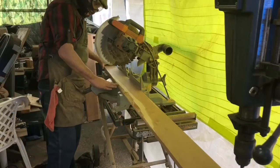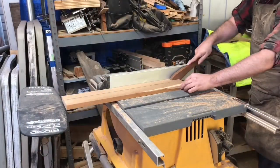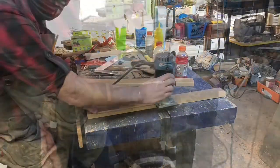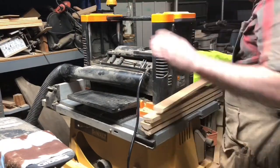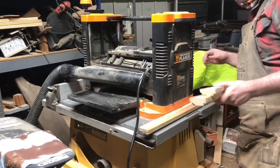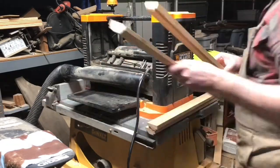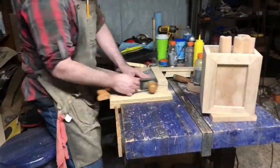In order to know how long the columns needed to be I needed to work on what I called the capital and the base, which are basically reflections of each other. I had to make two of the same thing — essentially like making two picture frames. Once I milled out the wood I routed out a quarter-inch rebate on one side and a Roman OG profile on the other, then planed it down until it looked nice and had an even profile. I think it ended up between five-eighths and a half an inch. The router bit needs some wood for the bearing to ride along, so I kept it thick, but once I had routed the profile I could plane it down until it looked good to my eye and give it a nice lean look.